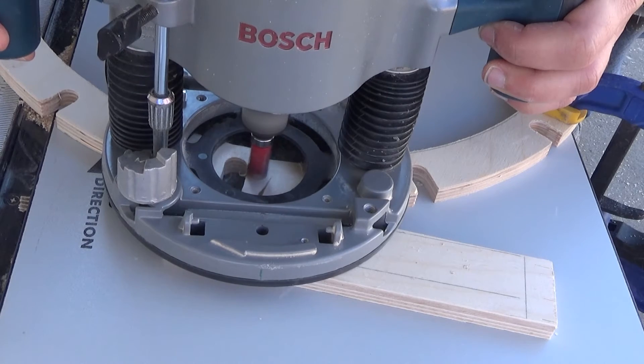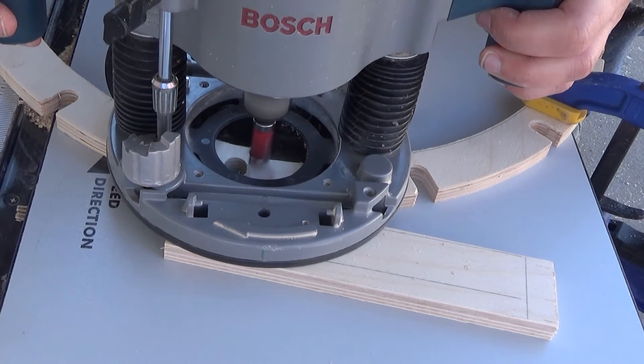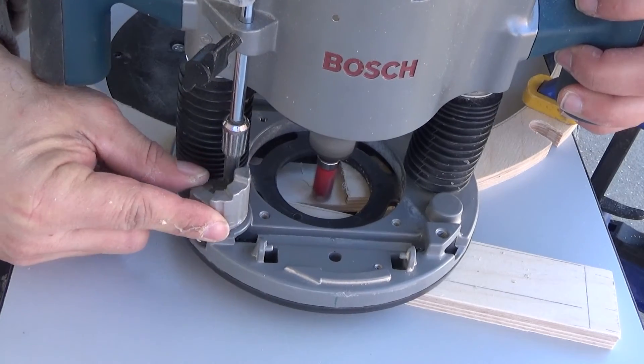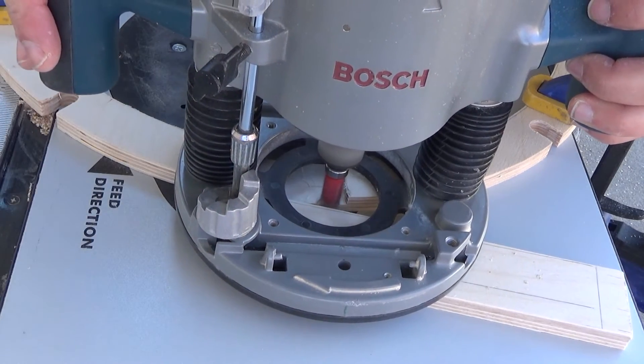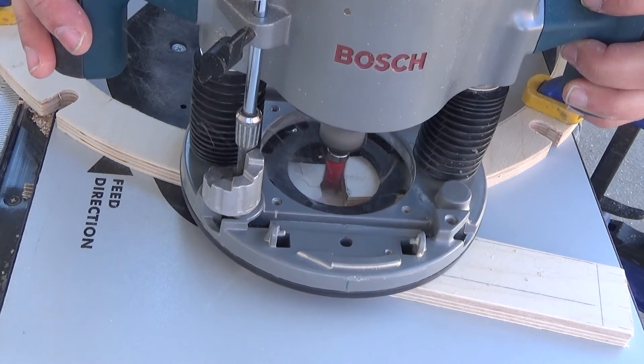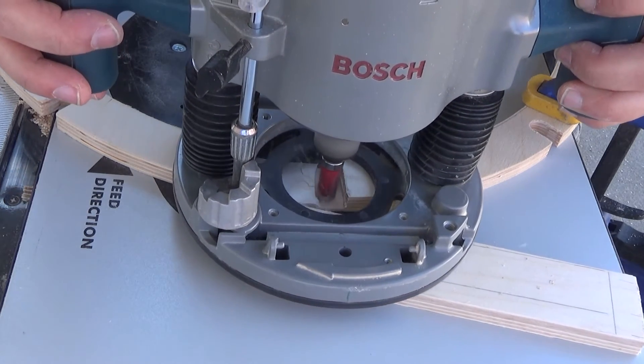Here's an upright — slowly go around that because you don't want to cut too much into it. You see the depth turret: just slowly work that down step by step until you're at the final depth of your cut. I've preached that all along — just slow and easy and you get this thing done. It'll look really nice by the time you're finished with your templates and cutting out all the plates.